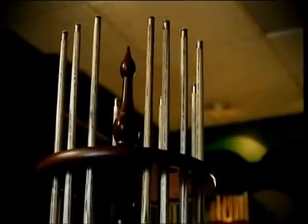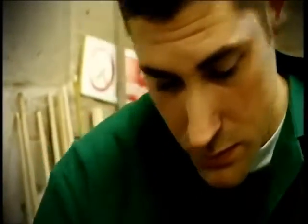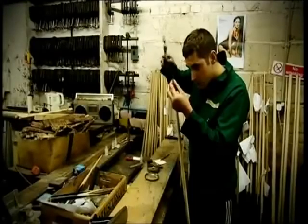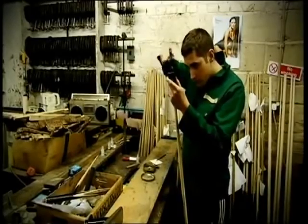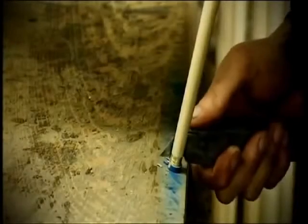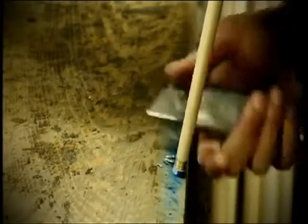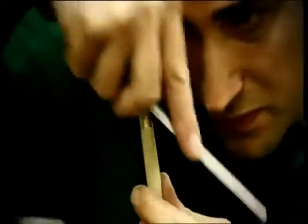The tip and ferrule are the business end of the cue. It's important that you get a really good fit with the ferrule, so we precision turn the tenon at the end of the shafts to within 0.1 of a millimetre — it's a very good fit. We actually compress the wood slightly as we tap the ferrule on; it's designed to go on slightly tight. Then it's a case of levelling it off, fitting a good quality tip and shaping the tip to a nice dome so that wherever you hit the cue ball, it's a similar shaped piece that strikes the ball and imparts enough spin.